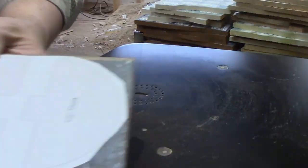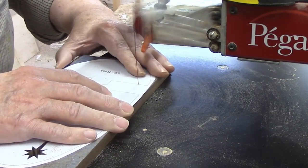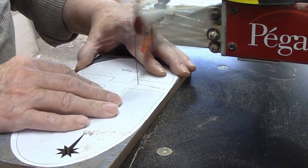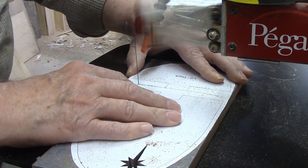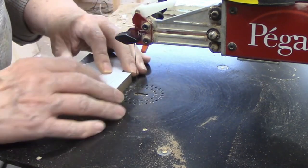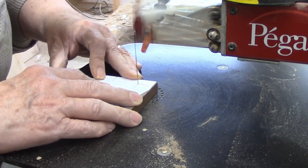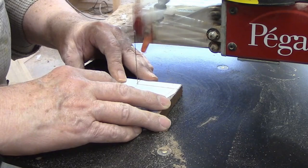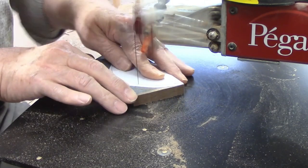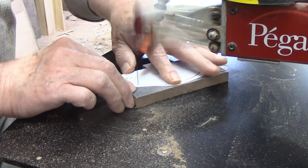The bottom and back could be joined with a butt joint, but I'm going to follow the pattern and make a slot and tab to give the joint extra strength. This is not a difficult joint to cut, but your cuts need to be accurate for a good fit. A loose fit will not look good and won't be as strong as it should be; too tight a fit may make it impossible to add glue without breakage. The tab must have sharp 90 degree corners. Rather than pivoting the workpiece at corners, I cut right to the intersection, backed the blade out, then cut across the board. Then I came in from the edge I just created to make the short cuts on either side of the tab, giving me perfect 90 degree inside and outside corners.